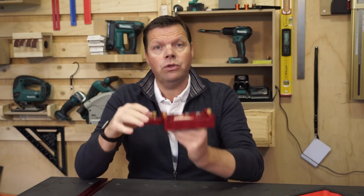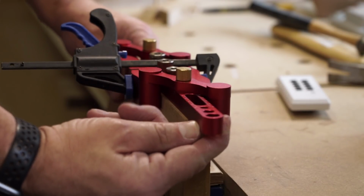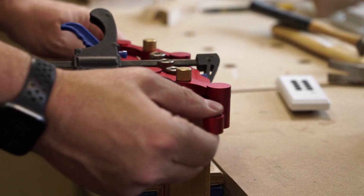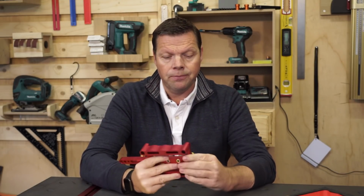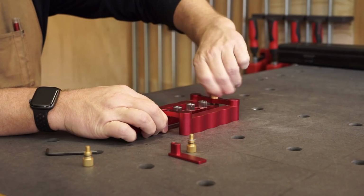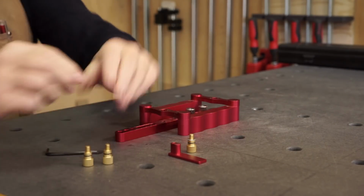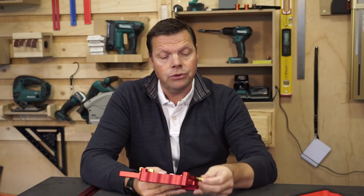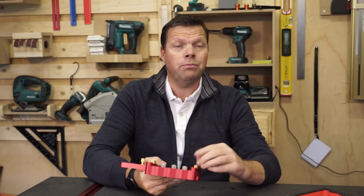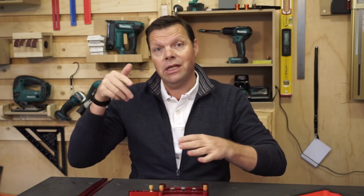That is not necessary to keep the middle bar stable, because even when you clamp it, there is some play at the middle bar. This is not a failure, but more a feature of this kind of design. If you look at the screws that connect the middle bar with the bridges, you see that there is a rubber ring that is responsible for this small movement. And I think this small movement prevents your drill bit and bushes from being damaged over time. So the reason why you clamp it is that you get both hands free to drill as straight as possible and keep this movement under control.